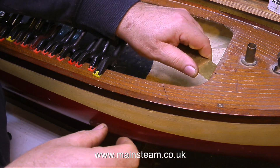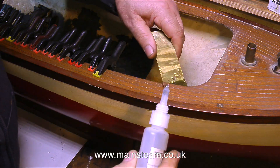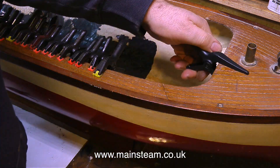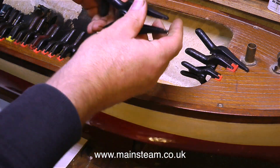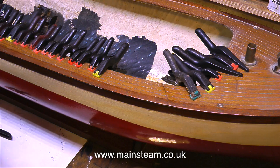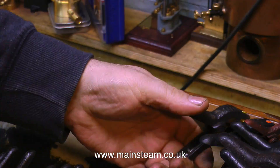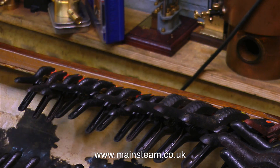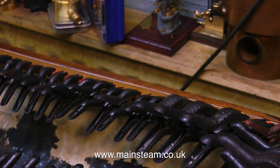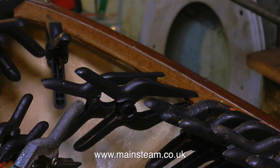I've got to the front part of the boat, and the veneer is not stuck hardly at all at this point, so I'm putting plenty of adhesive underneath. I'm wiping off any surplus that gets on the planks, but it's not a major issue — it does come off very easily. I will be giving the decking a light rubdown before wiping in a coat of polyurethane varnish, just to help the waterproofing and make it look better. Looking at the paintwork on the outside of the hull, I think I'm going to have to give it a full new coat — a rubdown and a proper paint job — because I can't really touch it up.